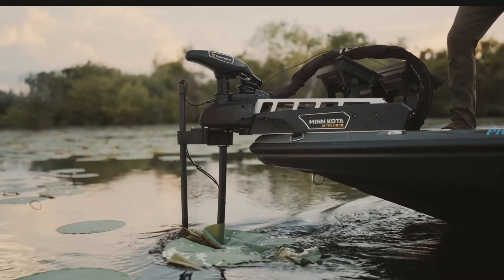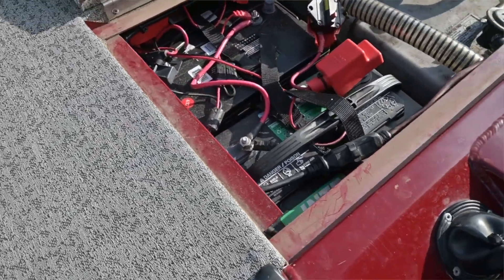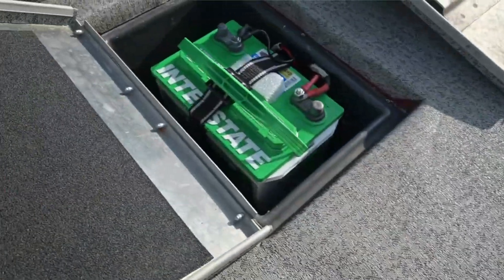Let me start with why would you use a 36 volt battery. One, you may be doing a solar setup or maybe in an RV. Two, you may have a 36 volt trolling motor. Depending on the configuration of your boat, you may not have enough space for three 12 volt batteries to make up 36 volts. A 36 volt battery gives you a lot of flexibility — you can take out three batteries, put in one, hook up two wires, and you are ready to go.